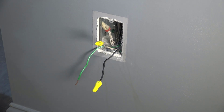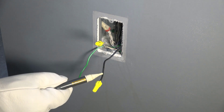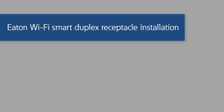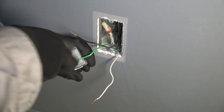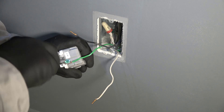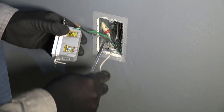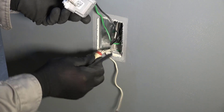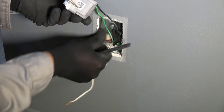This is the breaker or line wire and should be marked for reference. Turn the breaker off and verify that the voltage is off. To begin installation, connect the ground wire to the green screw on the smart receptacle. Connect the two white neutral conductors inside the box along with a pigtail to be terminated at the Wi-Fi smart receptacle.